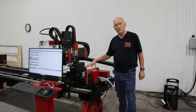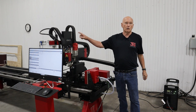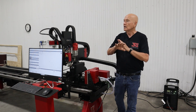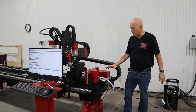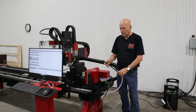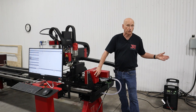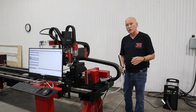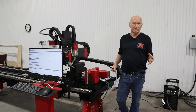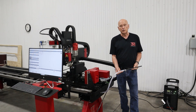I'm at the power head end of the machine, the XR6. What I'm describing to you also pertains to our rotary attachment add-on for our flatbed tables — the coolant systems work identical across all of our machines. What we've got right here is a half-inch OD tube that is 11 inches long and it basically fits into the cover right here. You've got this little screw that you can use your thumb to tighten down. The tubing, by the way, is braided, half-inch ID, three-quarter-inch OD, just vinyl tubing. You want to use the braided tubing if you can.